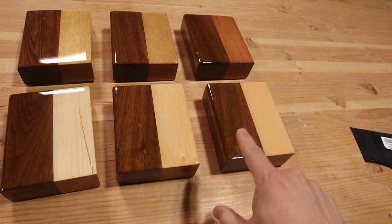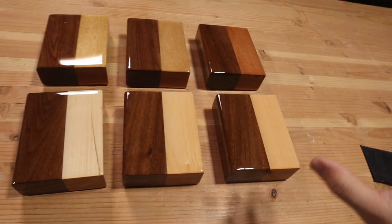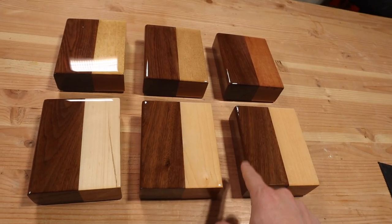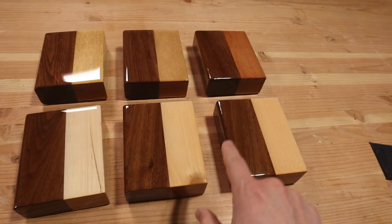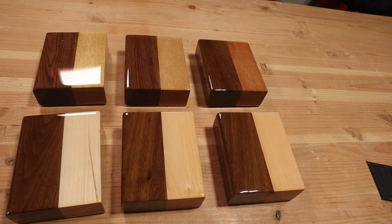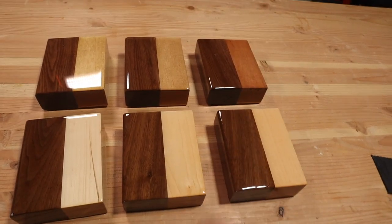So I need to make sure that when I come through on the table, I have everything sanded and clean, and make sure that I go over everything and there is absolutely nothing on the surface that is going to cause an issue like this, because in the final product, this would probably mean sanding it all the way down through the epoxy, reapplying the epoxy, and then trying to build that back out. So that is an absolute no-go. Really need to watch for that.